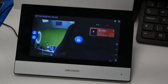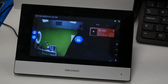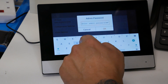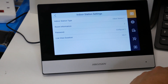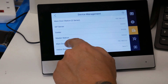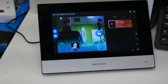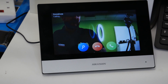It's very simple to use in this configuration. Basically out of the box you get great functionality like this, but we can enhance it a little further. To get the intercom to work, go into your Settings and the Configuration — sorry, Maintenance Configuration — type in the admin password. Then you've got the indoor station type. Click on that and set it to indoor station or extension. We only have one, so make sure it's set as the indoor station. Room information you can leave blank. Go down to Device Management and all I've done there is under Main Door Phone, typed in the IP address of that thermal station. Go back to the live view and the intercom can now make calls.